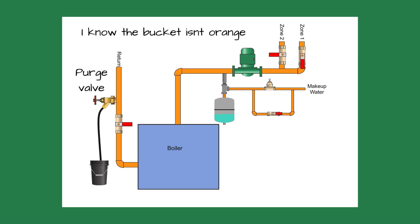It quickly filled the bucket. Be sure the bucket is close to the floor drain — it gets kind of messy. When my friend asked if he should empty the bucket, I shook my head. This is how we'll see if all the air is gone, I said, explaining that we keep flushing the water into the bucket until the bubbles stop.